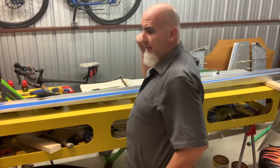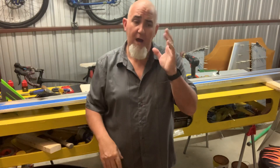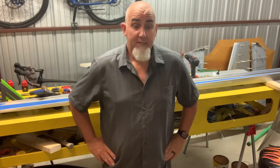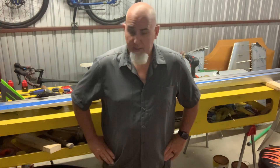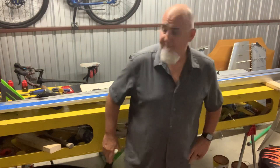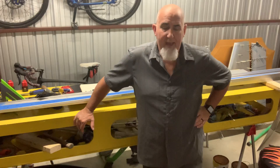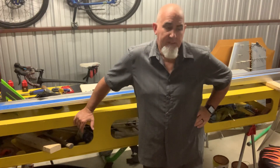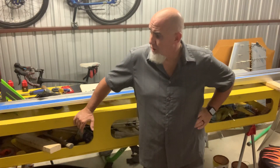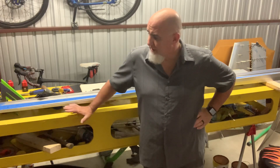I also laid out the end cut — it's at an angle, basically per the plans: 152 inches with a quarter-inch offset from the top. That's all laid out and ready to go. I'll cut that tomorrow by hand. I was going to use my porta-band, but the more I think about it I'll just do it by hand — it's not going to be that bad. I've got a couple of fresh blades, we'll soap them up and go after it. Worst case it takes me 20 minutes. I've got a great deburr tool now, so we'll clean that up and have it ready.